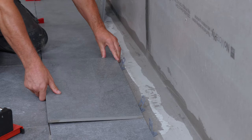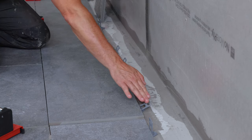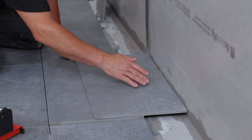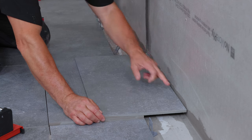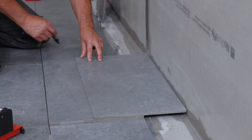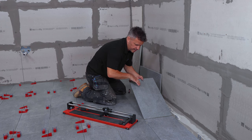Now I'm going to show you two methods of cutting straight tiles. One is to place a full tile on top of one of the tiles that are fixed down to the floor, making sure the edges and corners are flush. Then take a second tile, put it on top, slide it up to the wall keeping the edges flush. I leave about 4mm gap against the wall, and when I mark it at both ends with my pen I gain another 2mm, leaving me a full 6mm expansion gap. Simply mark it at both ends or do a straight line right the way through.